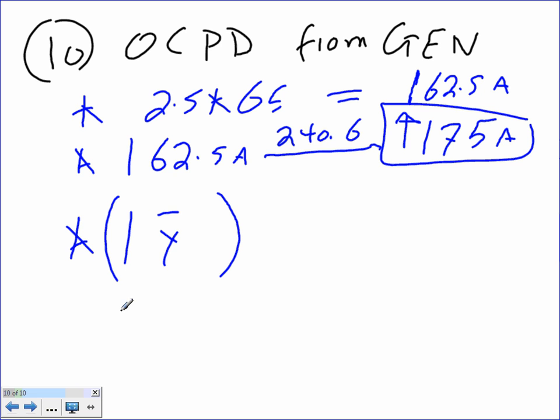So, if you're doing step 10, hold on a second. I made a mistake with this step. I'm going to change that one. 175. Hold your horses. When we do the feeder, guys, the overcurrent protection device in the feeder for motors, we take the largest overcurrent protection device, and then we add the full load current to it, and then we go down. So here's what I'm doing.